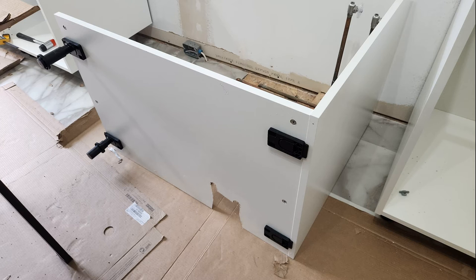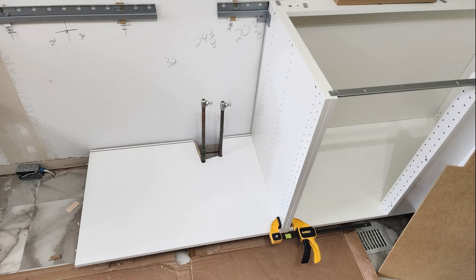In this case I can take the right side of the cabinet and the bottom of the cabinet, put them together, and then lift both of them into place around the pipes. As you can see I added the legs to the left side of the bottom, otherwise it's unsupported and you'll get some damage to the cabinet — so put those legs on and then hang this piece with those two together up on the rail.